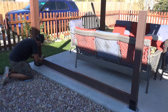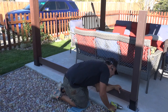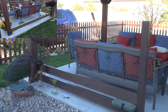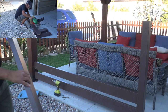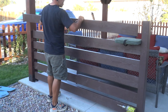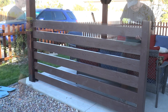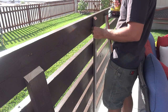From this point I can go ahead and start installing the 2x6 boards with the railing brackets attached in between, and this will be the same process as demonstrated in the beginning of the video. First I measure the distance in between, then deduct the thickness of the railing brackets, then use these measurements to make my cuts to the 2x6 boards. Then I attach the railing brackets to the 2x6 board ends, which then become ready for installing. I'm just about done here — all I have left now is to add a couple 1x4 vertical supports to the inside of this wall as I demonstrated earlier.